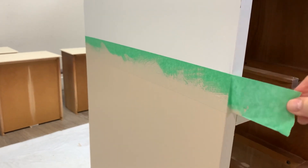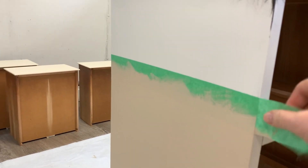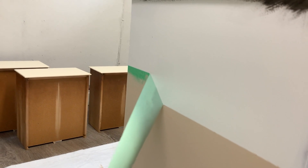I used green painter's tape to block off the bottom half and painted the bottoms in Sandcastle. While that was drying, I painted the top and the drawers in coffee bean — it's one of my favorites, more of a deep brown-black. I came back the next morning after all the paint had sat overnight, removed the green painter's tape, and found it had peeled off little bits of paint.